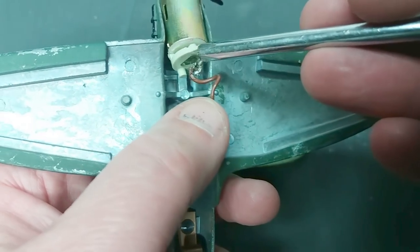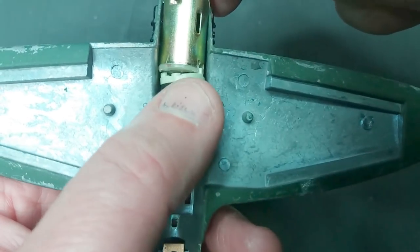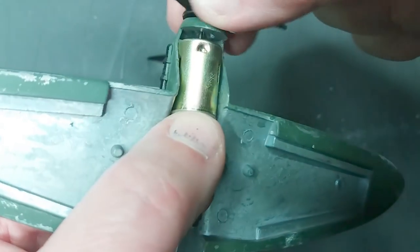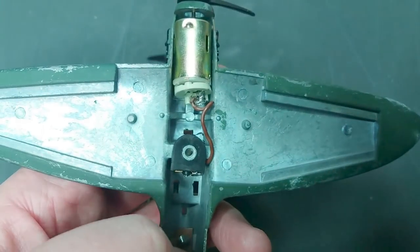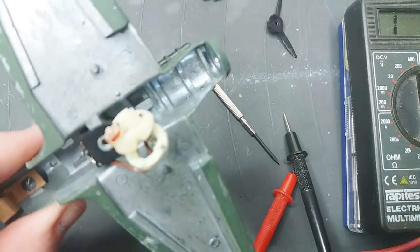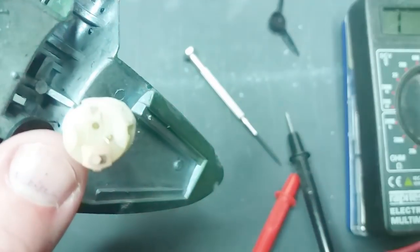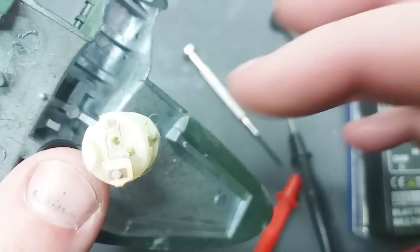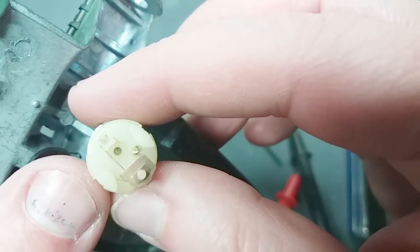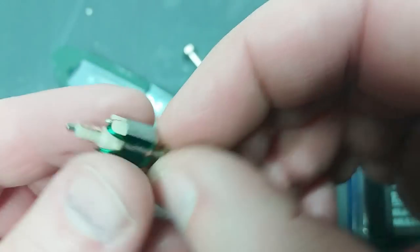There's a plastic spacer that adapts the motor for the Spitfire — you'll find a different adapter in the Sea King helicopter. There's a pretty hideous lump of solder on there, so at this stage I'm thinking maybe that's the issue. I've taken the motor out and taken it apart. There are no real brushes on this motor — it just uses two little hair-like wires to touch the commutator. One goes directly to the casing of the motor and the other is connected to the wire input.